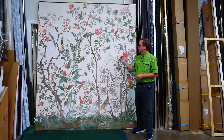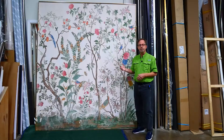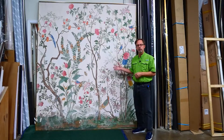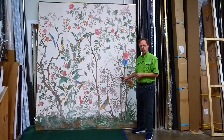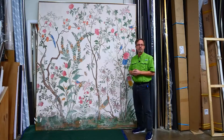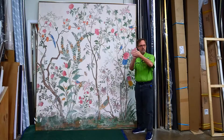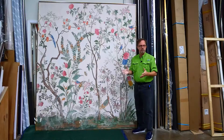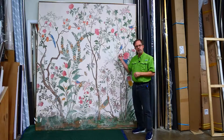There are three panels here, about 80 inches wide and 96 inches in height, so we had to do some fancy work in the back. There are five pieces of wood: three-quarter inch vertical pieces of plywood and two horizontal pieces of half inch MDF. When you laminate the wood together in opposite directions like this, it makes it really strong. We also put in a heavy-duty cleat in the back for hanging.